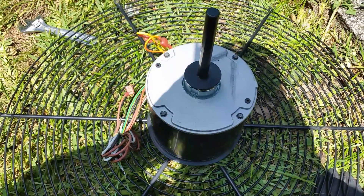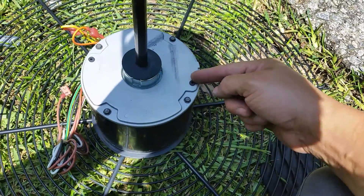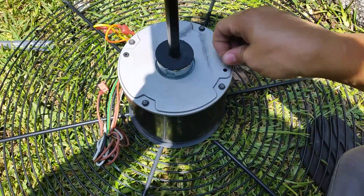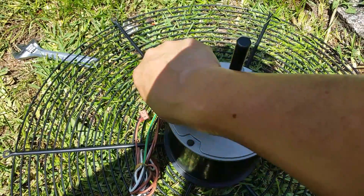What's going on guys, here's a quick 60 second tech tip on changing condenser fan motors. Whenever you're changing them, most all condenser fan motors have plugs that are supposed to be removed, depending on the orientation of the motor. Since this shaft is facing down into the unit, these plugs need to be removed.